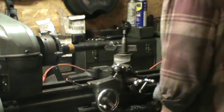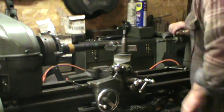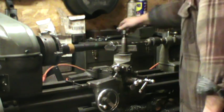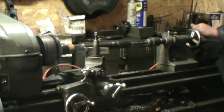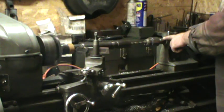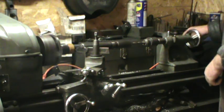But this one had already been drilled once before and screwed up by another builder. We're going to go for a 29/64" cobalt bit — there are stronger bits out there, but you've got to at the very least have a cobalt. We'll set it about half inch, tighten the chuck, set it again. Now we've got to take this slow because we've got to clean it out. I'm following how deep I'm plunging it on the drill bit — we're about an inch in.